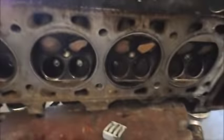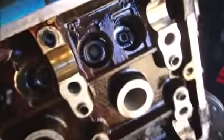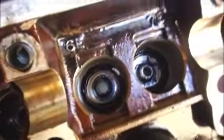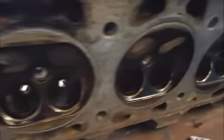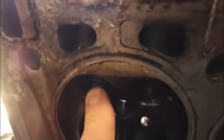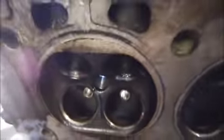Well, the answer would appear to be, here's the cylinder head, and you'll notice there's no inlet valves. So I've just taken off the 2 exhaust valves on that end, because I'm taking them all out anyway, and stuff my boots, there's no valve guide oil seals on there. How bizarre. So that'll explain why, when it gets a few miles on it, the bad boy drinks like a fish. So when it's ripped apart, valve guides, valve seats all look good. Remarkably good for an engine that's been down the scrapyard. Exhaust valve seats. Oh, it's all a bit black, isn't it? Not sure if you can see that, but they're not looking bad. So that's good.